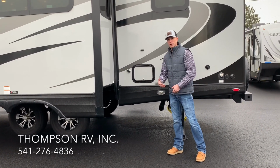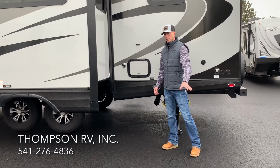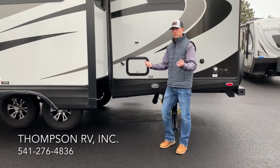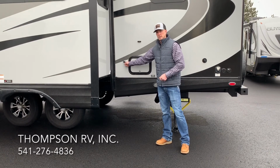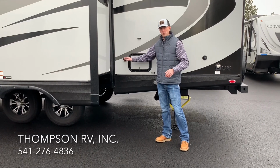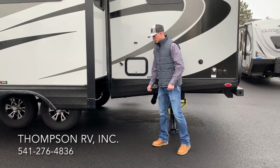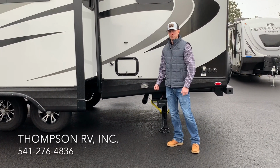We're going to open that black valve. It's going to dump out our waste. After that's run out, we're going to use our old garden hose, or we have a gray hose you can use. We just want to separate it from our fresh hose. We're going to hook up here to the Sanitary Flush. That flush has a sprayer head inside that tank. It's going to spray that black tank out. So we'll run this at high pressure for a few minutes. Once that's cleaned out, we'll come over to our gray valve, open the gray valve, and that's going to flush out our hose as well.